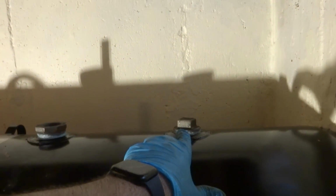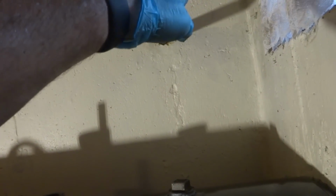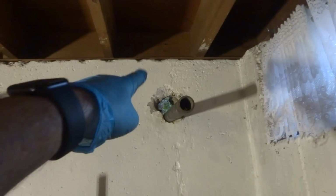I was gonna come off, use this tapping, but the problem is it's right in line, and you wanna pitch them up. You wanna put a swing joint on them and pitch them. So I'm gonna come off of here, two elbows and out. Come off of here, two elbows and out for the vent, and that'll be the fill, it'll be lower.